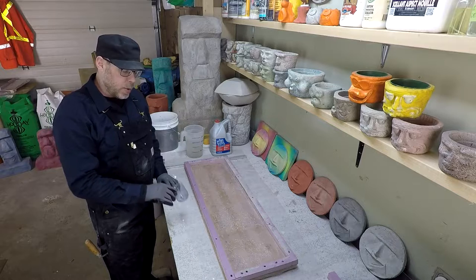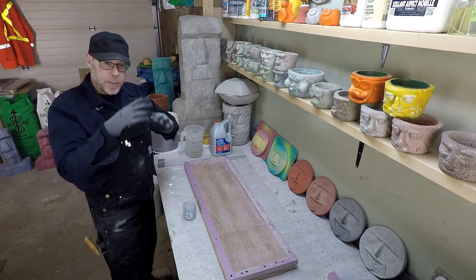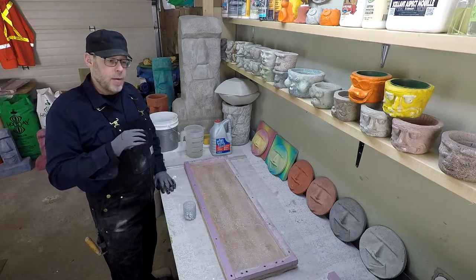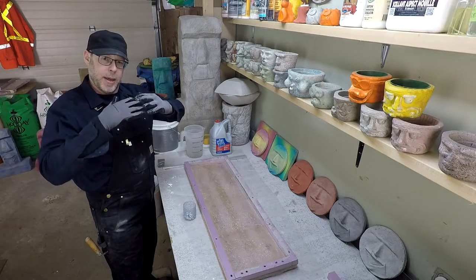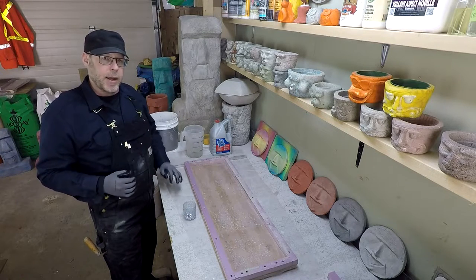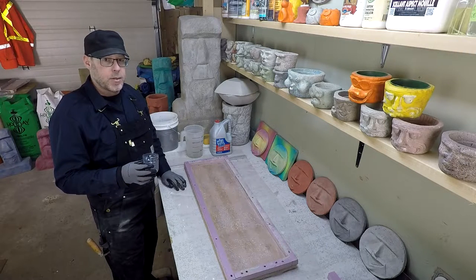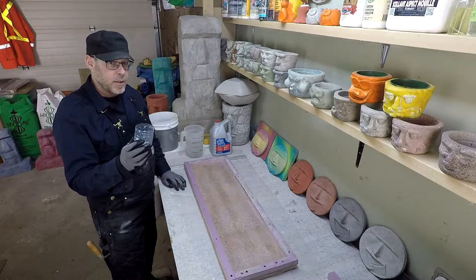Now, in this case, we're going to use fibers in place of steel. You add them to the mix, and they get dispersed randomly throughout, and it kind of creates like an interlocking network or matrix of these fibers such that if the concrete were to break, they will all become under tension at once, and it will prevent the two pieces from breaking entirely, much the same way that steel works in concrete. So if I'm making a perlite mix and I want it to be stronger, probably one of the things that you should do is add some fiberglass to the mix.